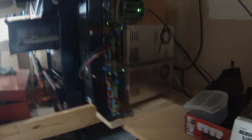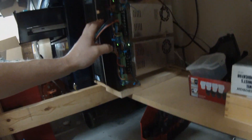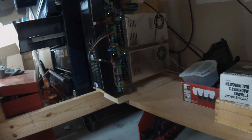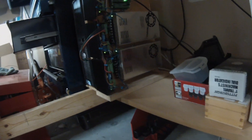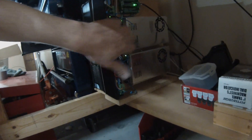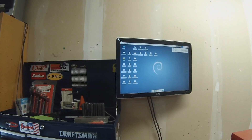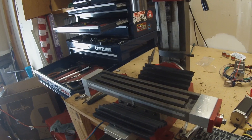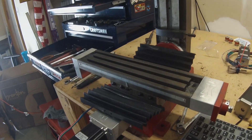I got my Y axis wired up, with wires running down below the table to all my electronics. Right here is the stepper driver. The signal from the computer comes into this board — it has optical isolators so there's no feedback to blow up your computer. That sends the signal to the driver, which gets its power from these two power supplies. The computer is sitting beside it running LinuxCNC. I just fired it up. First I'll show you the table moving.